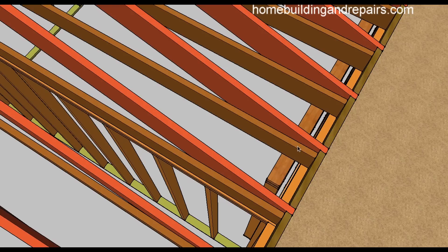Here's the wall supporting the ceiling joists and the roof rafter. Sometimes the roof rafter is going to be sitting on top of the wall, and when you build your new wall it might not be supporting the very end of it. If this is the case, you might need to install some additional blocks so that the roof rafter is actually supported.